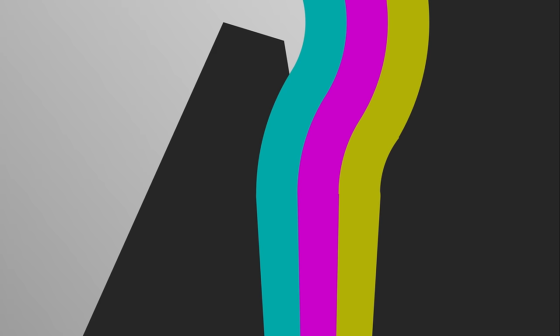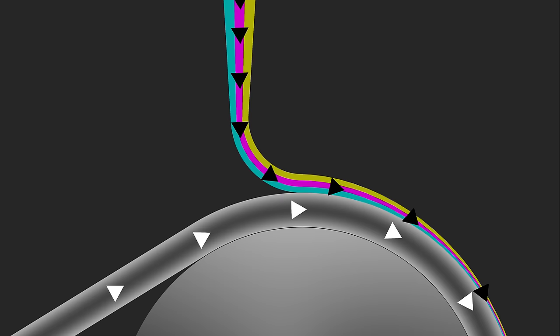As that fluid comes up through the slot and turns to get in line with the laminar waterfall, I like to think about what's happening there — how is it making that turn without mixing up? There's something really interesting happening there. Also, think about the interface between the metal and the bottom layer, and the air and the top layer. The fluid is accelerating on the way down, which means it's thinning out, but the support itself is moving faster than the waterfall is falling, which means it thins out even more. So you have two different thinning sections — the fall, and as the backing accelerates away.